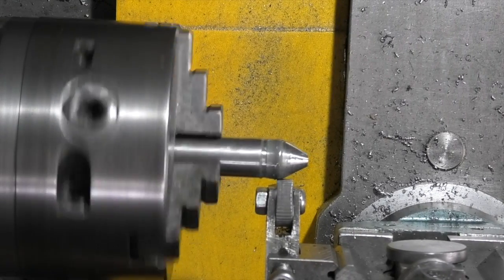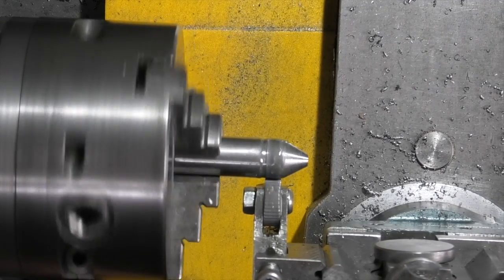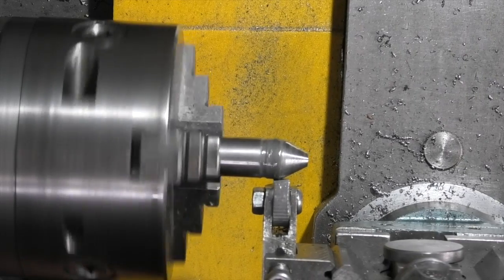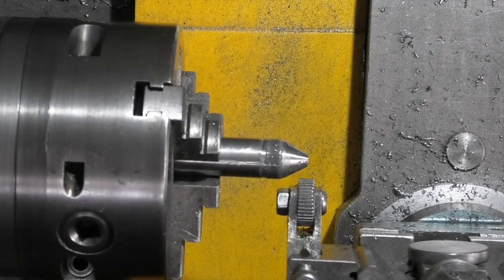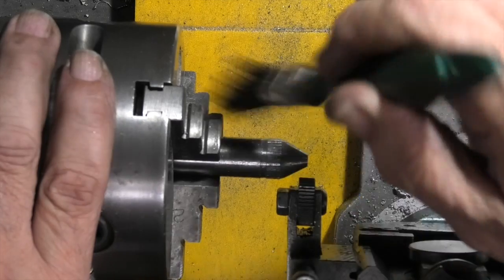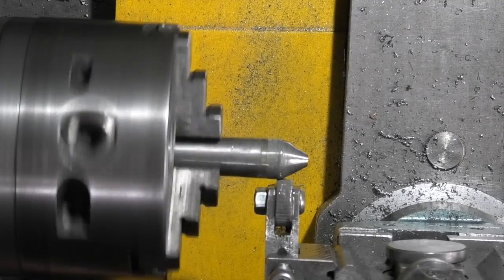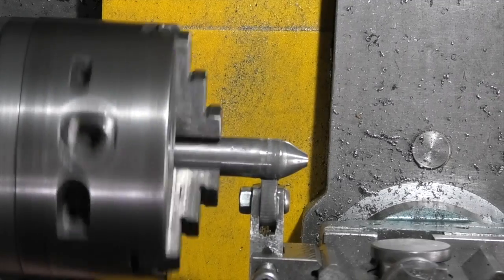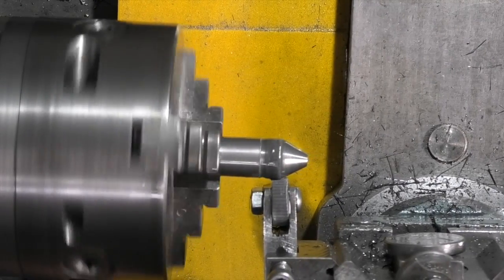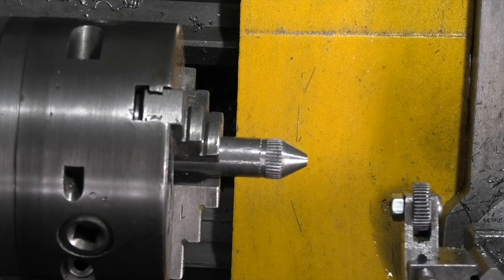This type of tool puts a lot of pressure on your bearings, which is why I wanted to make another knurling tool. Because there's only one wheel it's not clamping onto the part - it's pushing the component across. Keep the knurling wheel clean. I think that will do - yes, that's a nice knurl.